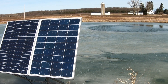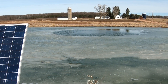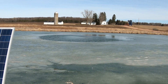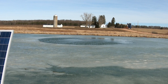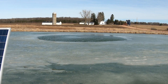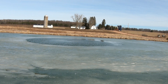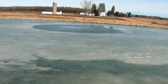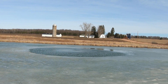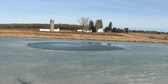With this setup, the aerator usually runs all day long and part way into the evening, but it does shut off a couple hours after it gets dark. By morning time when the sun starts to come up, the pond aerator kicks back on and starts to open the ice back up. On really cold winters it will freeze completely shut and sometimes won't open up for a few days, but it is still getting air underneath the ice and that will keep your fish alive.